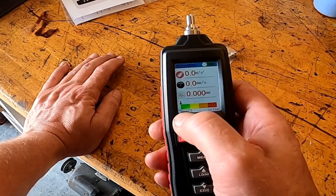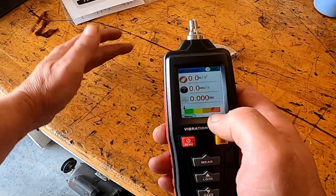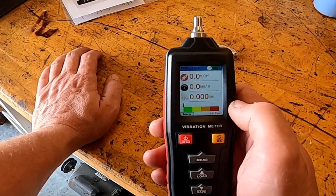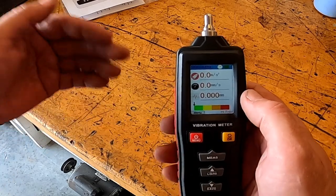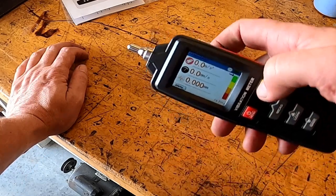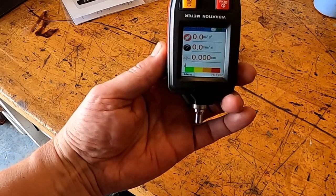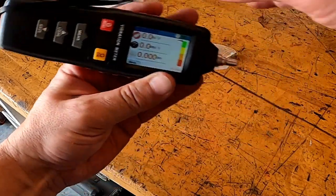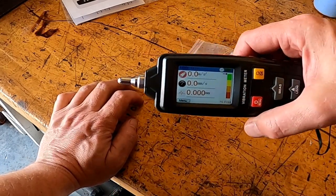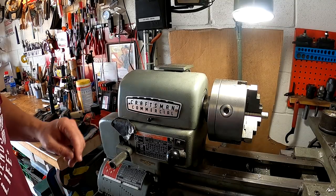In quick test mode you can see both low and high frequency readings along with amplitude. There's also an arrow across the bottom of the screen that indicates whether you're within an ISO standard — from the good range all the way to the bad range for bearings, gears, or whatever you're examining. The screen also lets you change measurement direction — you can go in vertically, sideways for a bearing, or straight up axially against the end of a shaft.